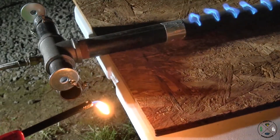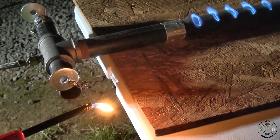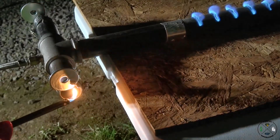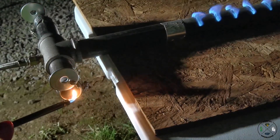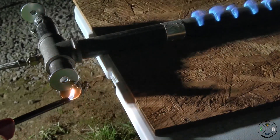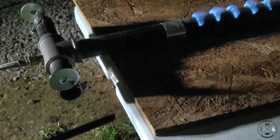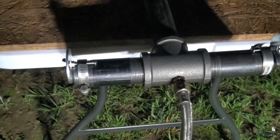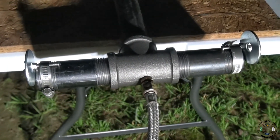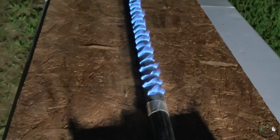We've got a little wind and this lighter's flame is actually blowing to my right. Watch as we get closer to the Venturi — see how it sucked in there. You can see it's actually pulling air in, and that flame is just proof that it's pulling air in from both sides. So we hope you gained some useful knowledge on how easy it is to build your own homemade Venturi for your homemade pipe burner. Thanks for watching.